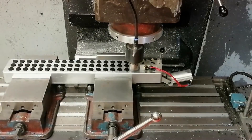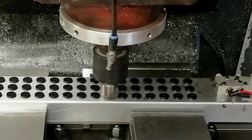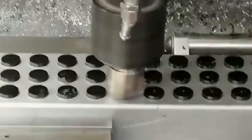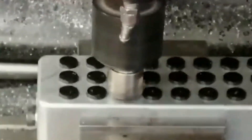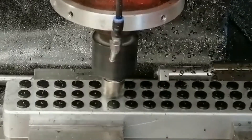Here's a modified button face mill I use for Delrin plugs. It faces them to length, chamfers and spot drills, all in about a second. And with tandem milling, I can face off two parts at once. Cuts the cycle time down and eliminates back cutting.